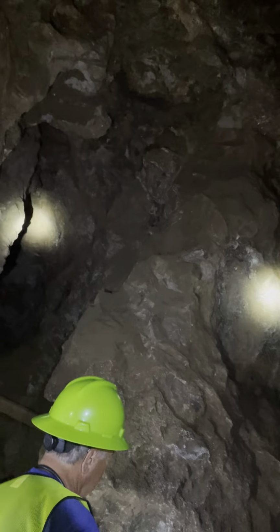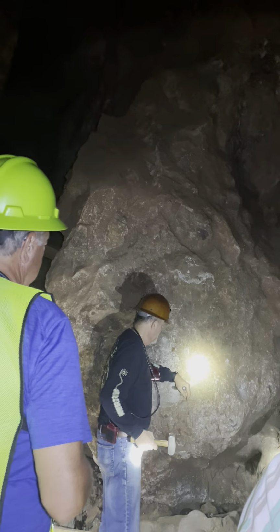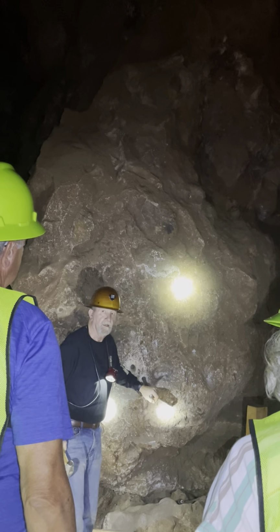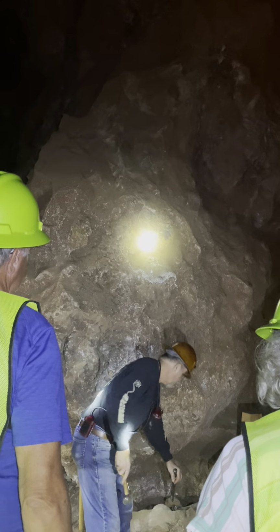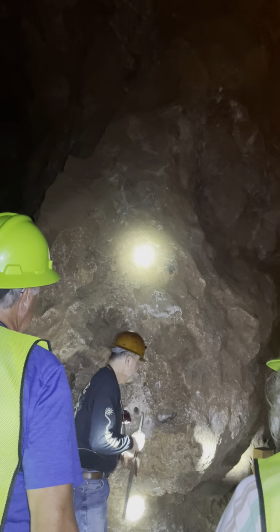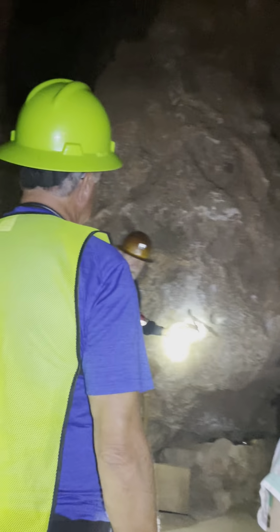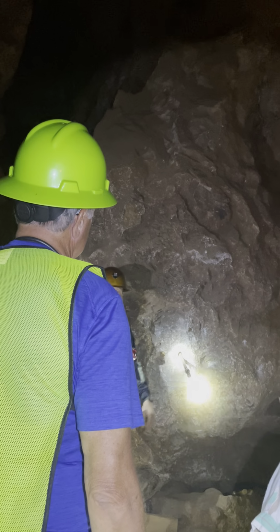They would start with a single jackhammer and a short bit, just like this. They'd start their hole, they would hit it, quarter turn, hit it, quarter turn, hit it, quarter turn, and that's how they drill. Once they got their hole deep enough, or collared they called it, they would go to a 3 foot bit and then eventually to a 5 foot bit. Now there were 2 miners that worked in here on day shift, 2 miners that worked in here on night shift. One miner would hold the bit, the other miner would swing the double jack. And they swing this thing for 8 hours.